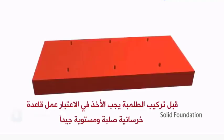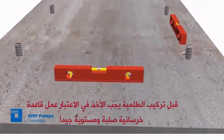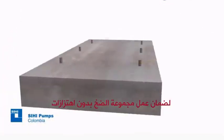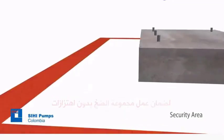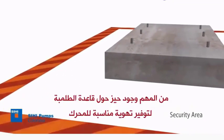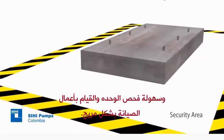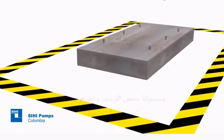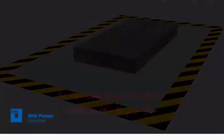Before installing the pump, make sure to count on a solid, flat, leveled out, and robust foundation to ensure a vibration-free operation of the motor pump set. Provide enough space around the base for proper ventilation of the engine and to comfortably perform inspection and maintenance works. If possible, you should have at least 70 centimeters on each side of the foundation.